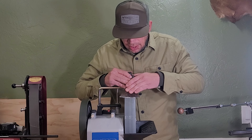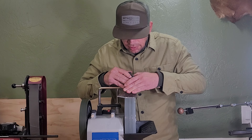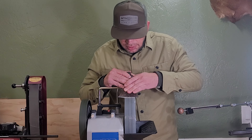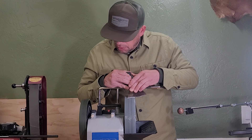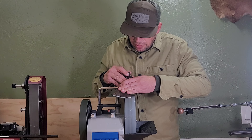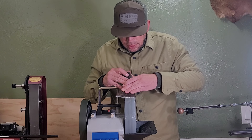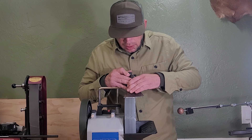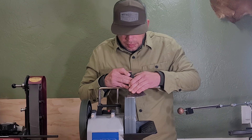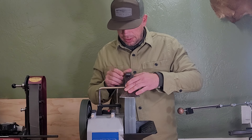Because I could go side to side, but the shape of the axe head or hatchet head is round — it's kind of rounded a little bit. So when swinging it like this, you get that nice rounded look to it. We'll just keep working on this side. When we get into these corners, you've got to tilt the other end up just a little bit — make sure you get the corner nice and good. You may have to move it over a little bit if it's not centered on your wheel. Just make sure you're centered in your jig system here.